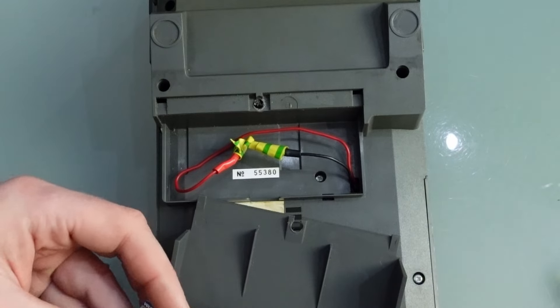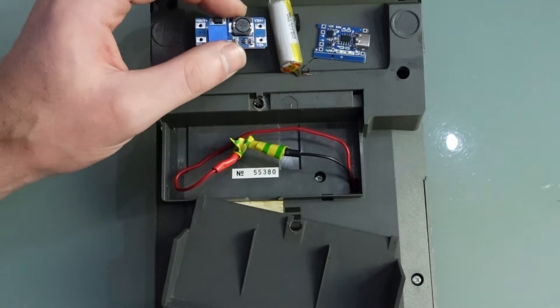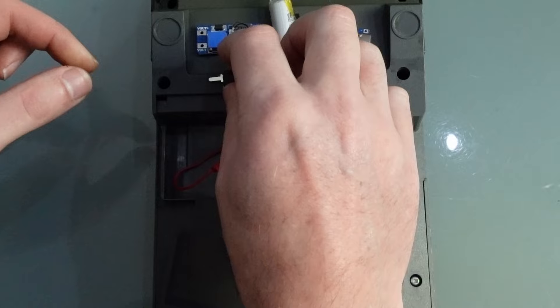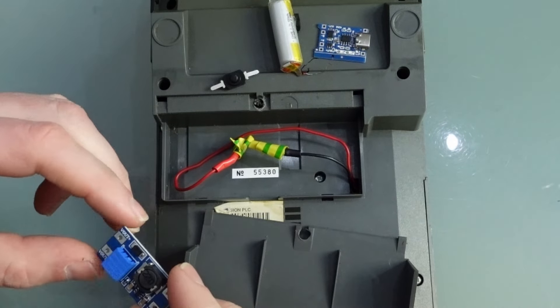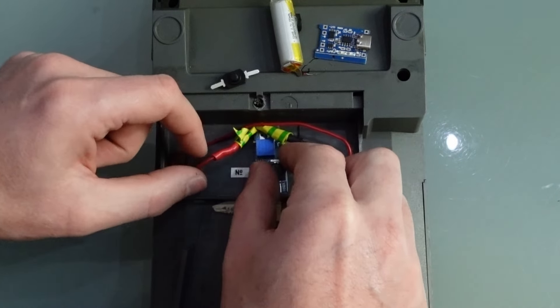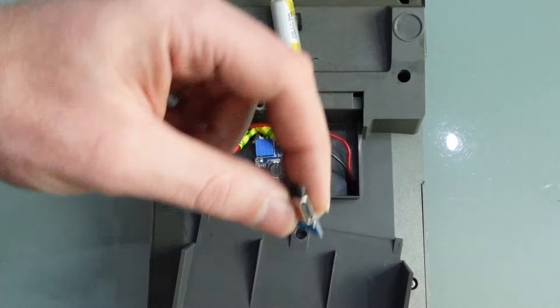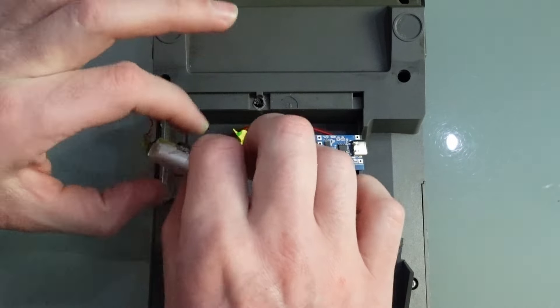When we put the back off the battery compartment, you can see there's actually quite a lot of space inside, which is going to make this conversion much easier. So far, this is my plan for fitting everything in neatly: with the USB socket on the hidden side of the battery compartment underneath the printer, and the DC-to-DC converter mounted centrally so I can easily connect it to the existing plus and minus terminals for the original battery.